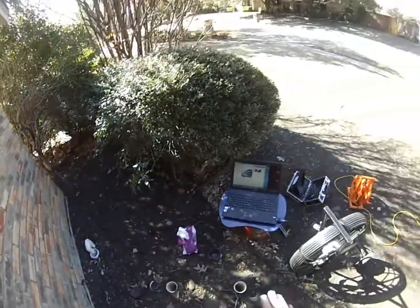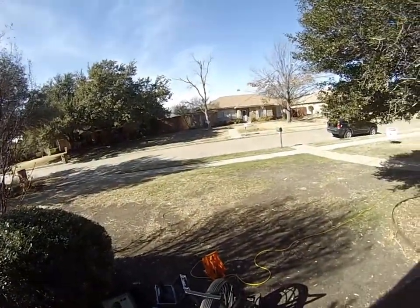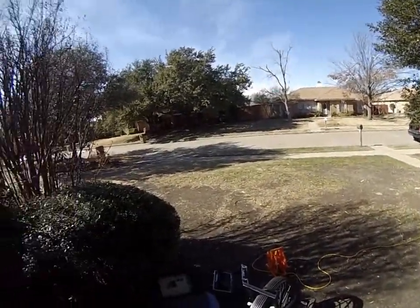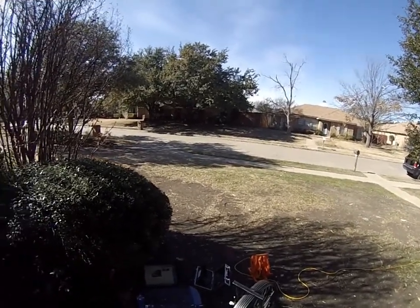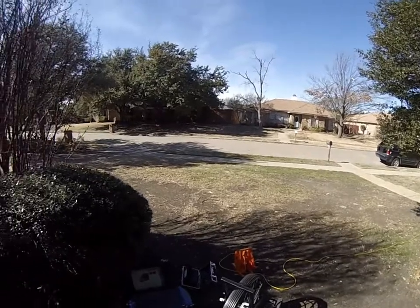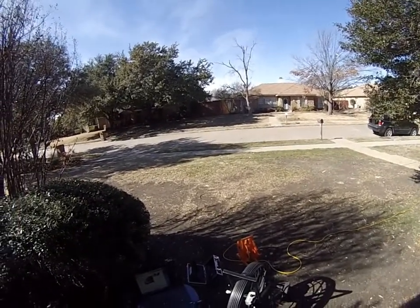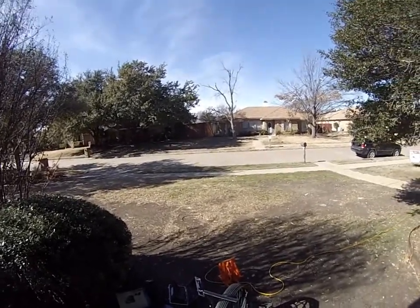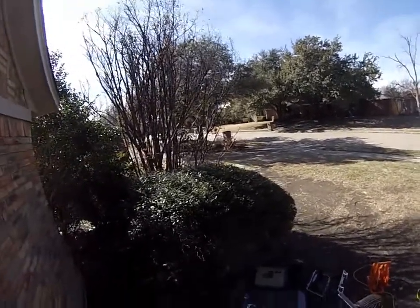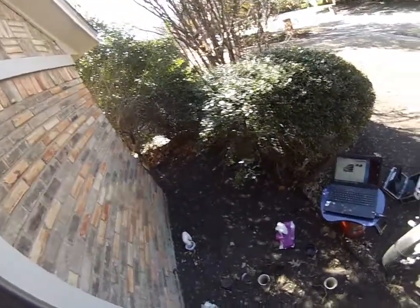So we've run the camera down to the city. We didn't get all the way down — it was a tight turn and the camera wouldn't go around it. But it was intact all the way down. I thought it was a break, but it wasn't — it was just an elbow. But there's mud in that part of the sewer too. Mud coming in lays in the nooks and crannies of the pitted sides and walls of the sewer line itself. So this sewer line probably needs to be replaced.